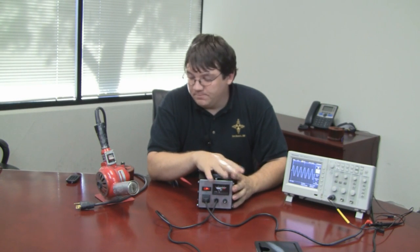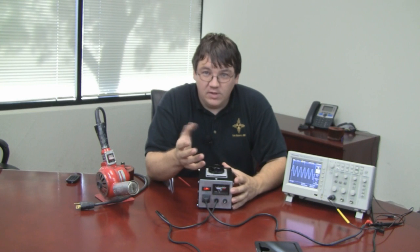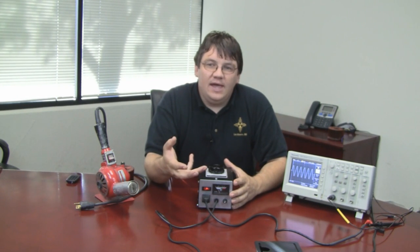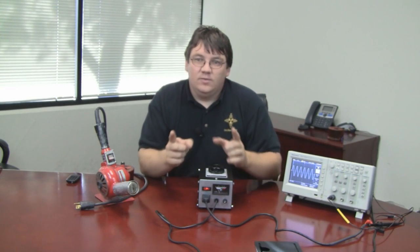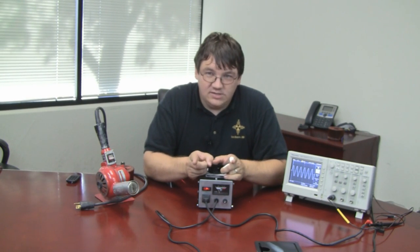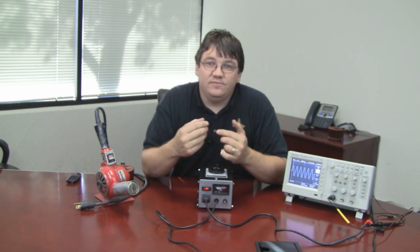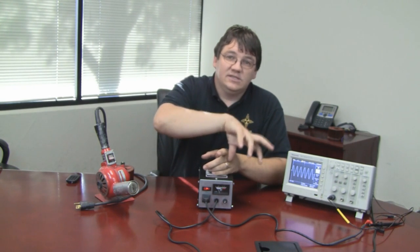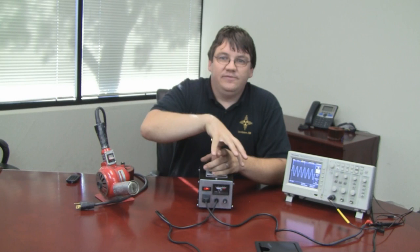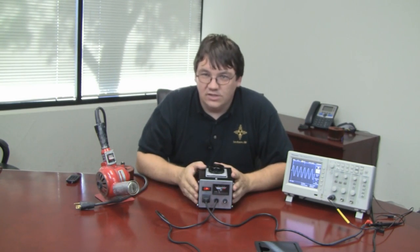When you pass the electrical current through the coil, as in an isolation-style transformer, you establish a magnetic field in the core. With an auto transformer, the winding continues past where the connection points — where your line feed is — so you actually have a longer coil than what you're feeding. What this accomplishes is that the magnetic field influences back on itself on that coil, and you can get a greater voltage out of just a single coil.